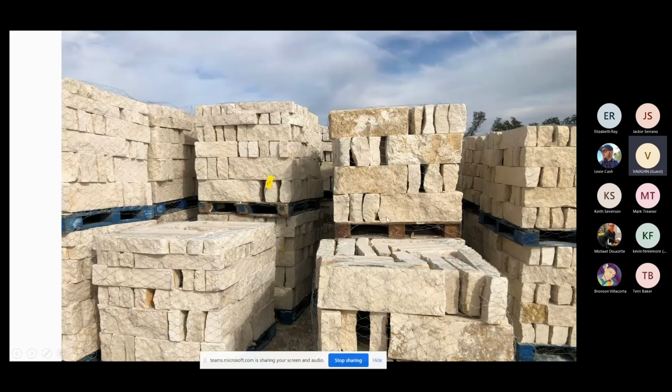But I want to show you something too. You see this, the 4 inches. This is going to be 4s. This is going to be 6s. This is going to be 8s. And if you can see the thickness from the edge of these stones, nice and clean, a little bit off. But look when you come over to an 8-inch and look at how far that crack had to travel. You see how they arch and they bend and they bow.